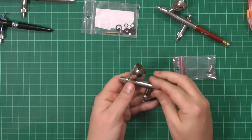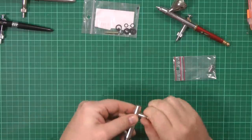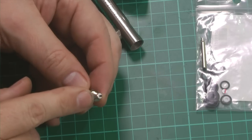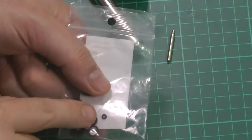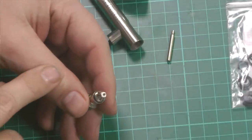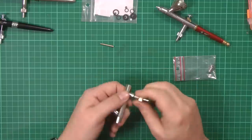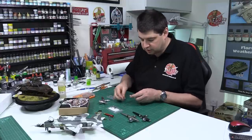So that's your various tools. Now this is the bit we're focusing on. If I can get the bottom air stem off — there we go. This is your air stem, and it should have a white seal on the end, which is a Teflon seal, versus the rubber ones in the pack. If you've got a rubber one, just replace it with the Teflon one — you can buy the sets of seals. That's the one that causes your airflow problem. If you still have the issue, just relax the air stem off a fraction — unscrew it slightly — and you'll notice it makes all the difference, because too much pressure on that little hole squeezes everything just a little bit tight.